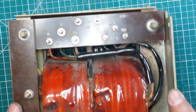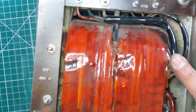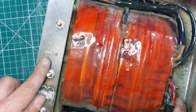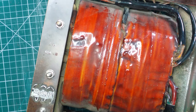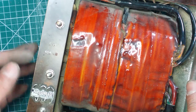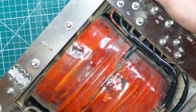We do have quite a few tabs on this, but the actual tab used for the power supply is these — they're feeding 52 volts straight into the transistors and then dropping them into the transistors and the pass resistors. So those suckers are going to get really hot if, say, you dial in 2 volts and draw 40 amps, and the pass transistors had to drop a lot of voltage and current through them. No wonder we got 12 of them running there.